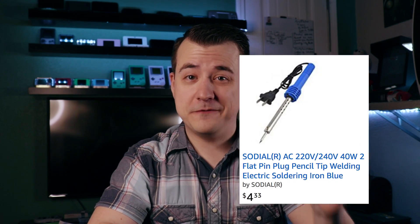Here are two features that you absolutely need to make sure you get when you go to buy a soldering iron. The first is adjustable temperature. Depending on what kind of components you're working with, how fragile they are, and what type of solder you're using, you're gonna want to be able to turn the temperature up and down. A lot of the really cheap ones don't have this — they'll just have a wattage specified on them and the soldering iron is just stuck at the temperature it heats up to. The other feature is interchangeable tips. The tip of your soldering iron is going to wear out eventually, and it can also be really nice to change out the size and shape of the tip depending on what you're working on.